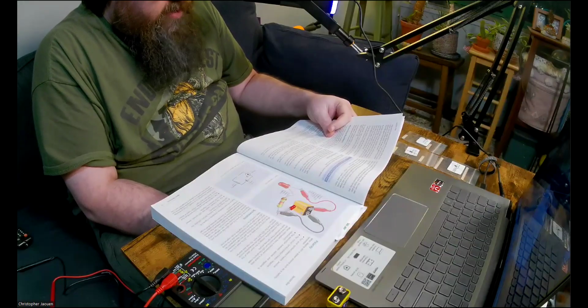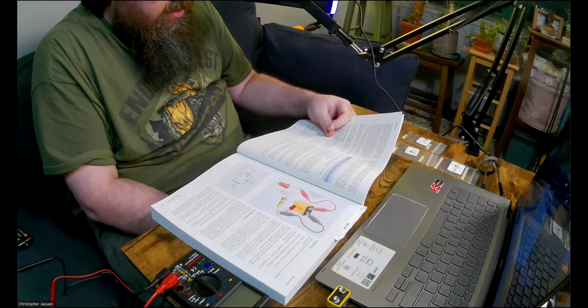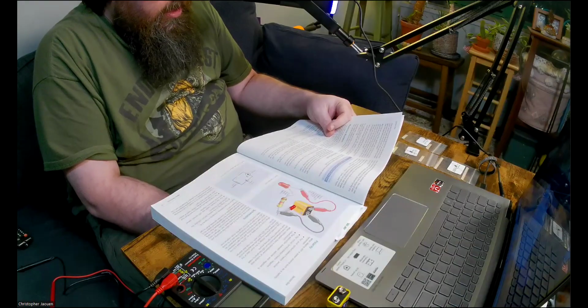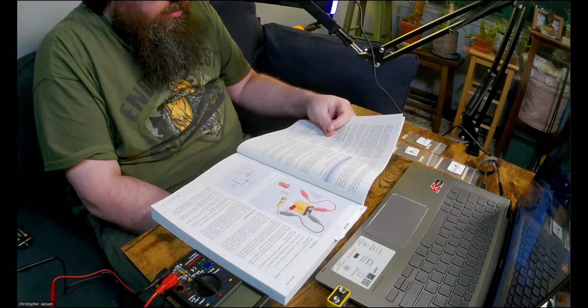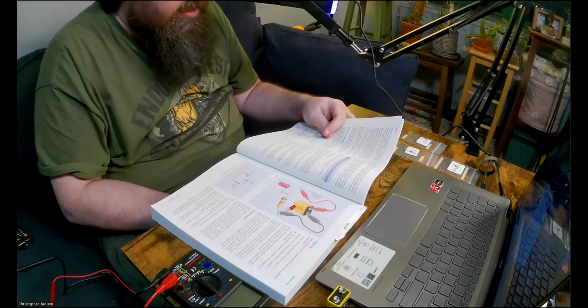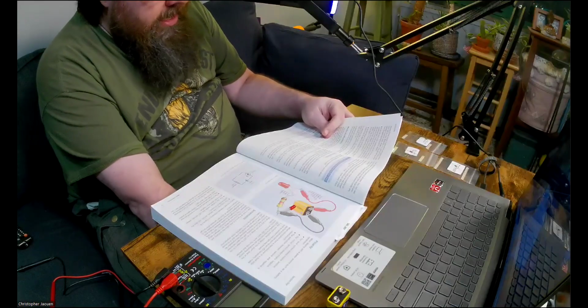Start with your 1.5 kilo ohm resistor. That's the one with brown, green, red colored bands. Grip it in a test lead connected with the negative side of your 9-volt battery. The resistor can be either way around, it doesn't care. Now use your test lead to grip your LED as in figure 2.7. I'll show you the pictures in a second. You do need to be careful to connect the LED the right way around, as shown.